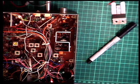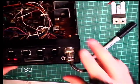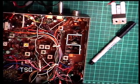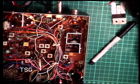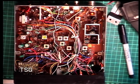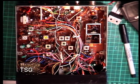Oh great, we're now greeted with a display. So we're getting somewhere. It says receive. It goes to transmit. I can see it's doing some transmit power, and hopefully public address now works. Testing 1, 2, it does. Oh, great. Well, that was a bit of a corker because it was so kind of held by the plastic. It must have corroded away or something, but that was a real corker of a fault.